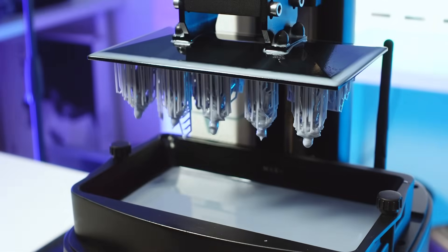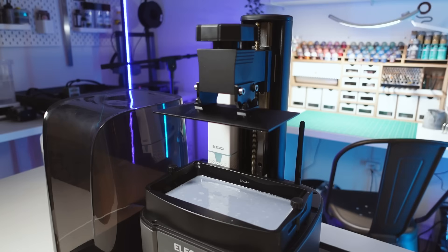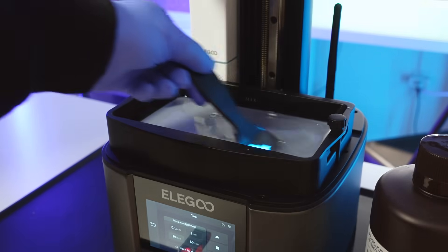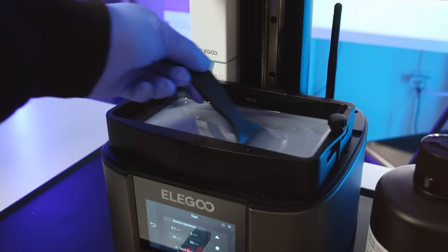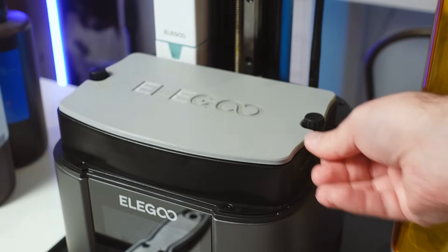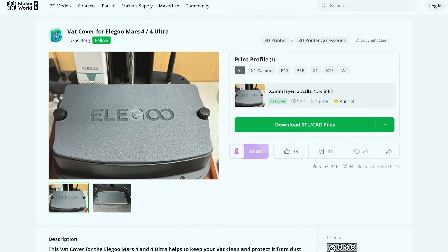Eventually the print will finish, and if everything went well, a completed model should be stuck to the underside of your build plate. If you know you'll be printing again soon, a helpful tip that saves a bunch of time is to leave your resin in the tank. These printer lids are UV protective, so there's no risk to the resin hardening. If you do this, make sure that you give the resin a good stir before printing again with the plastic tool that was provided with the printer. Remember to never use the metal scrapers on the printer vat's film. I also like to double up on lids to ensure there's no lingering resin odors — this one was 3D printed on my FDM printer.